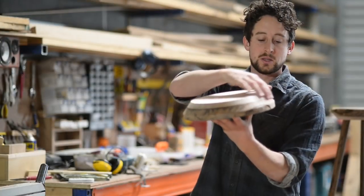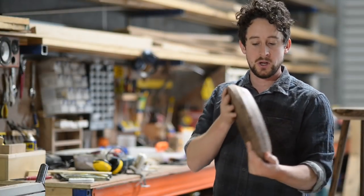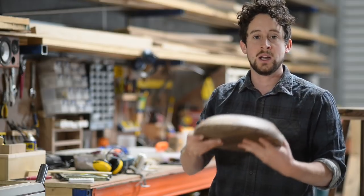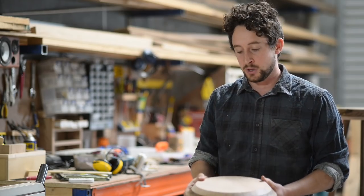That's all cut — it's all nice and smooth. I'm just going to sand around those edges; I want that transition to be a little bit smoother. But it's a great effect — you just can't really get it any other way. You can alter the angle just by altering the angle of the blade. It's fantastic, really useful.